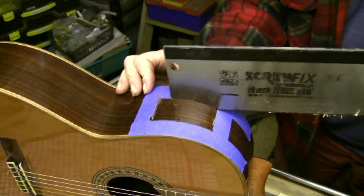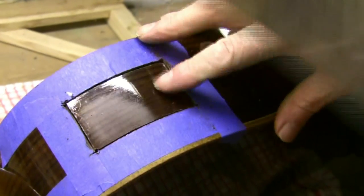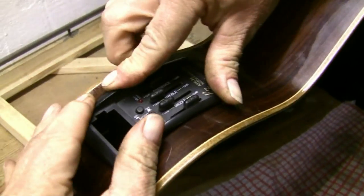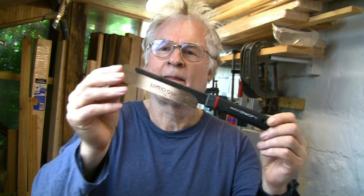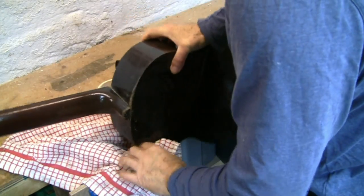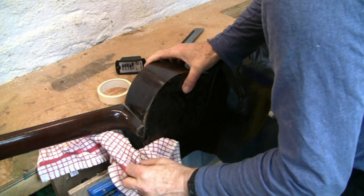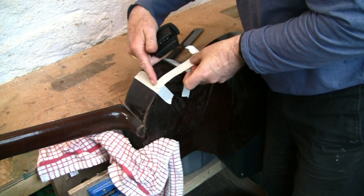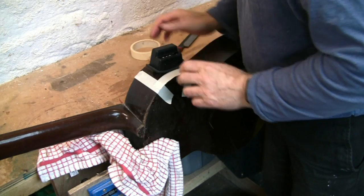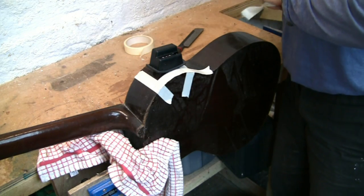Not long ago some of you were a little shocked at my seemingly risky improvised cutting away of a slot in my guitar to make room for a pickup. I did say I'd go through the technique again using a better saw such as this one and also securing the guitar firmly. Somebody suggested the operation could be done with a Stanley knife, but no — there would be less control cutting through the hard cellulose lacquer and the 3mm thick guitar sides would be unsupported. So this is the method if you're going to do it by hand, and actually it's very quick — really a lesson in tool control and looking at efficient ways to tackle the task.